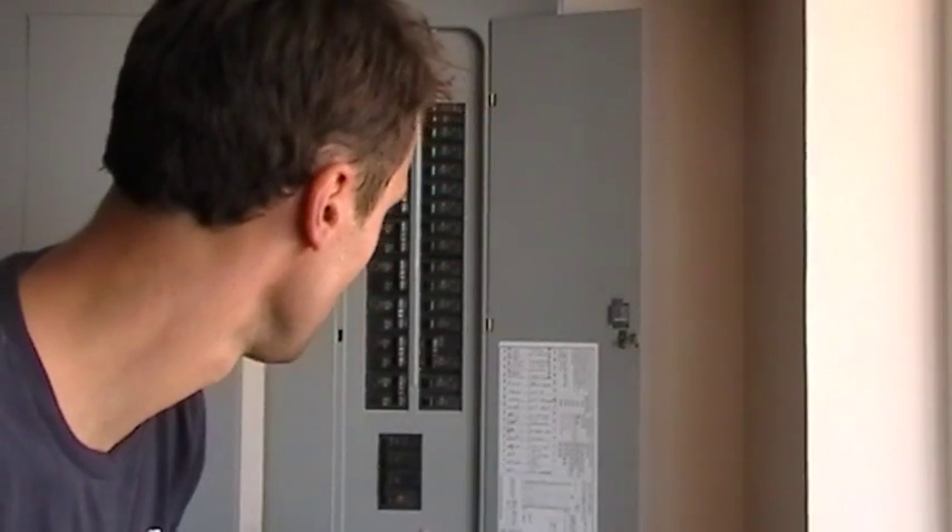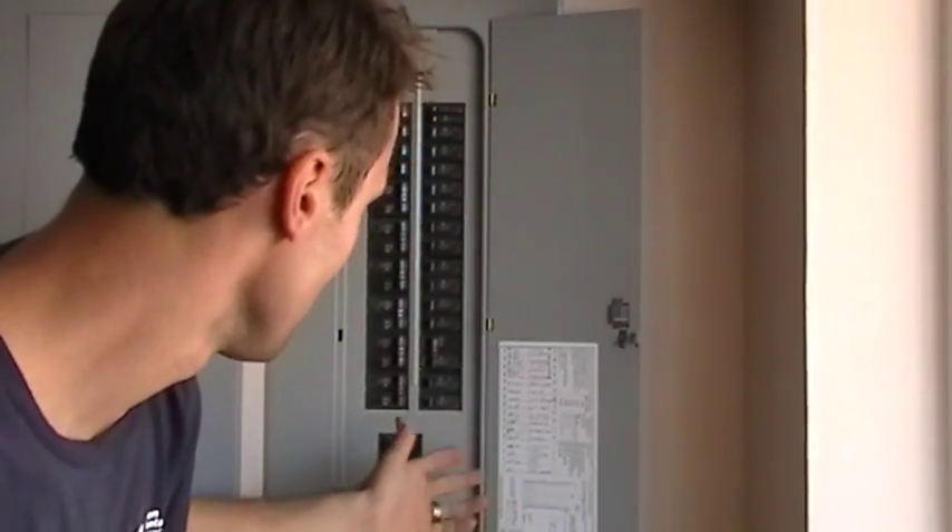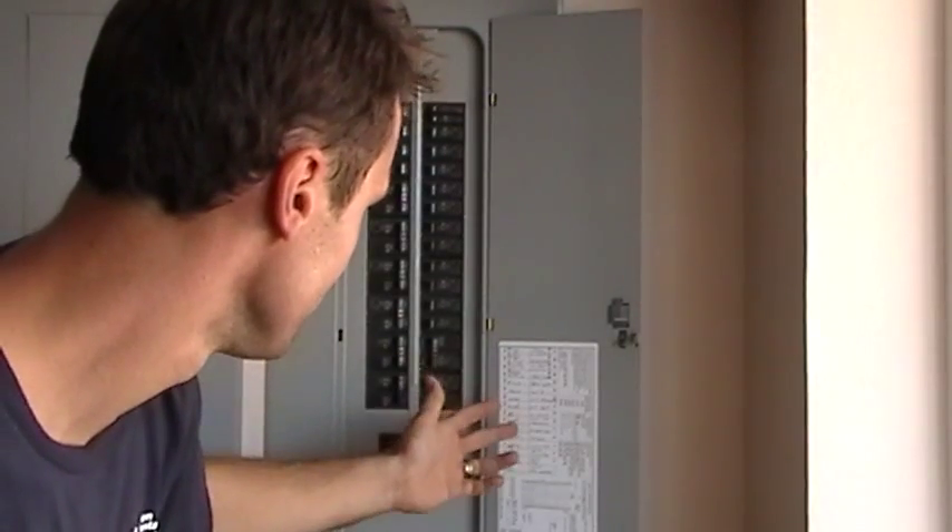He can't run the air conditioner at night when there's no solar producing power on the roof — he's got to shed some of those loads. But he's got his freezers — two freezers hooked up — refrigerators, the electric ignition to his propane stove top, and a whole house fan. He can use that instead of his air conditioner to get the heat out of the house at night, and that's going to be a lot less electricity than running 10 tons of air conditioning. He's got lights in the grandparents' room, lights in the kids' room, and outlets hooked up. Critical loads, people — you can't run everything. You've got to pick and choose: freezers, refrigerators, lights, outlets, and maybe your air conditioner. You can do that.